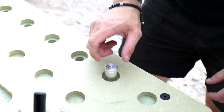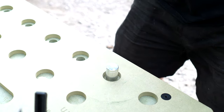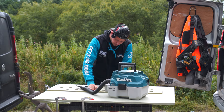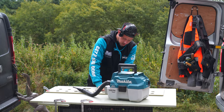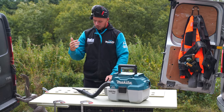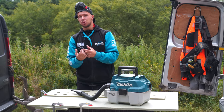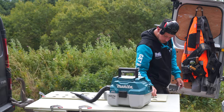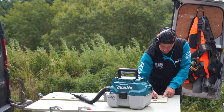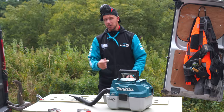Zero play on that whatsoever — that's the one. All the bench dogs are tight and we haven't got to do a second pass. On some occasions you might have to do a second pass should they get a bit of dust at the back of the bush, so that's always worth noting. Now I know my bench dogs are as tight as can be — let's move on to the next two rows.